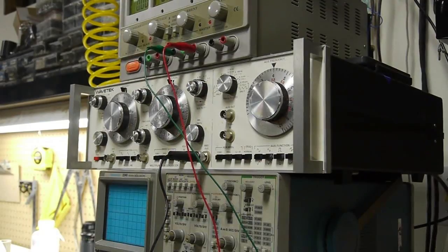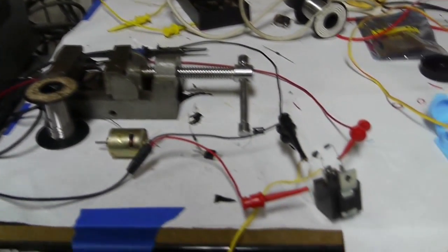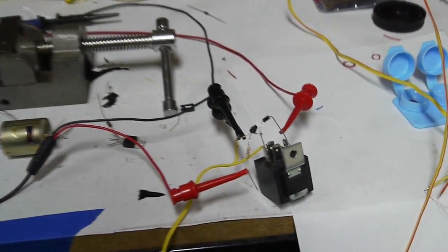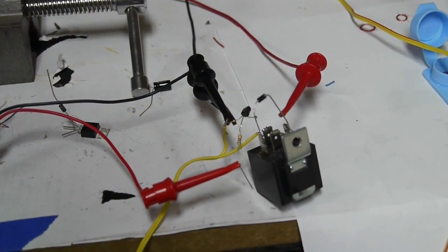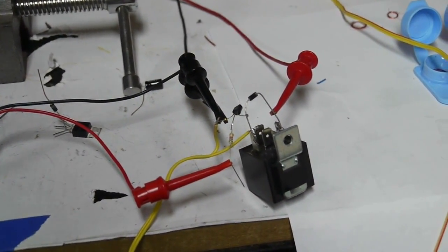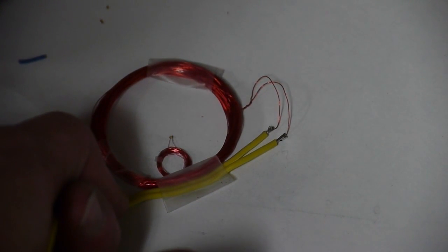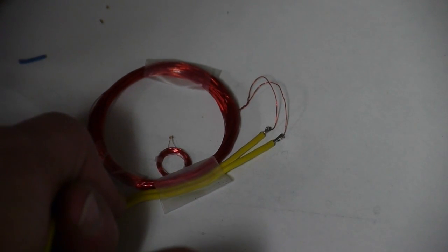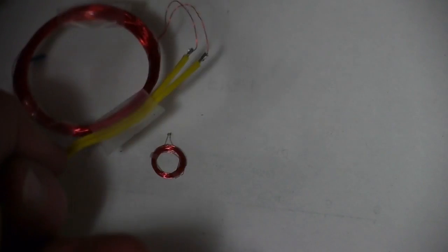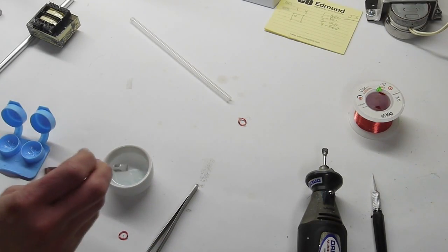I figured I would just turn the relay on and off over and over again to make a little strange spark gap transmitter. I used my frequency generator and a simple low-power switching transistor just to open and close the relay, and that dumps power through the transmit coil a few times a second. I tested it out on the bench and put the small 40-turn receiver coil inside the transmit coil, which has a diameter of about an inch and a quarter, and it was reliable — I could get the LED to flash pretty well. So then I proceeded with the construction of the contact lens itself.